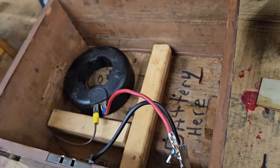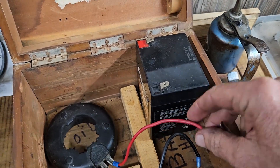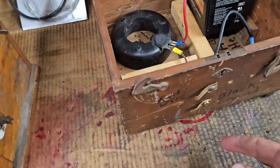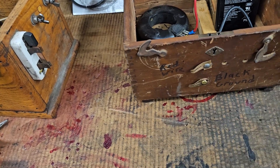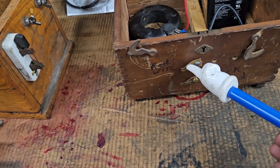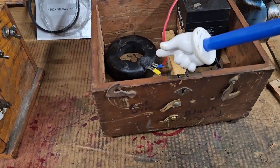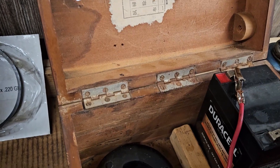I'm going to grab my battery here. We put a battery in here — the way that I hook them up is I go red into the coil and then out of the coil to this stub here. By the way, these are parts off of old Model T coil boxes — the bolts that come with the Model T coil box. So I come out of the battery on the hot side into the coil, the electricity goes around, and it comes out to this top part here, and then I do the ground here.